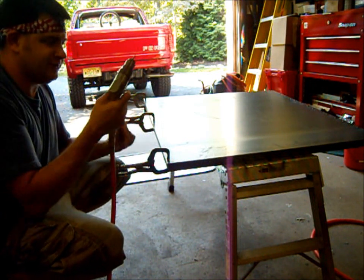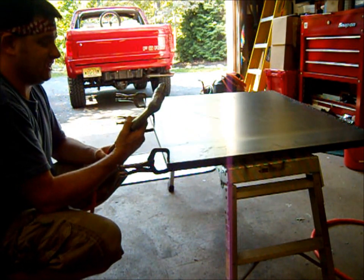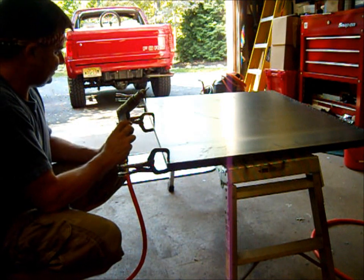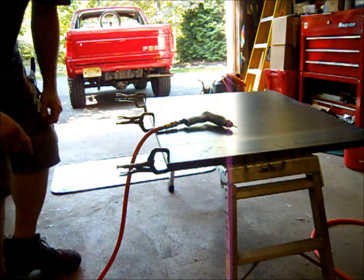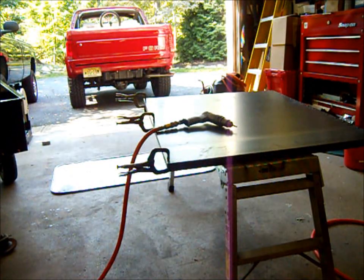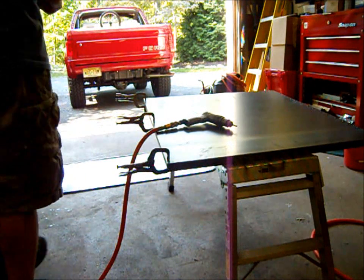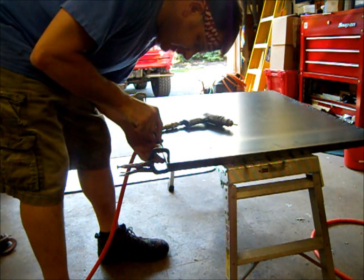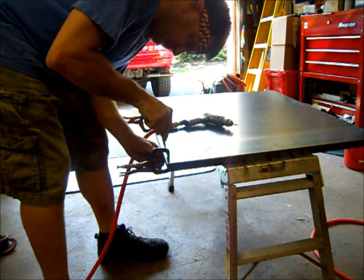So I have this nice little drill — I've had this drill since the 80s, it's ancient, but it works awesome. We got our 3/16 bit in there from Eastwood, and I'm going to use my center punch and drill some holes in this side. So with the automatic center punch I did 16 holes, trying to match the other side.